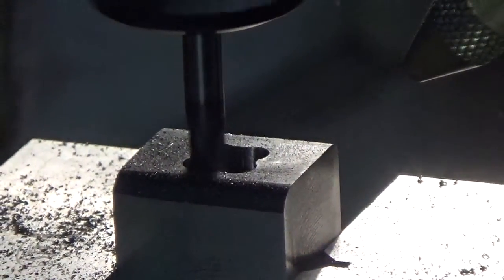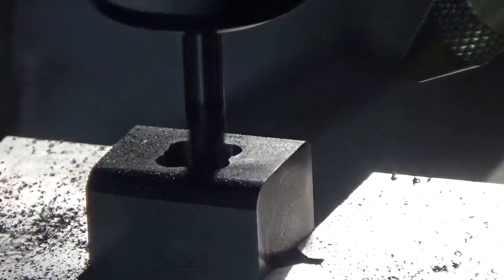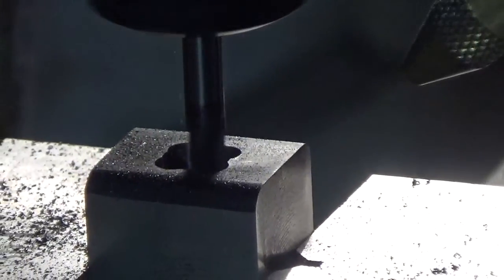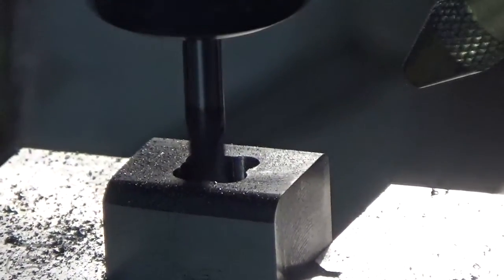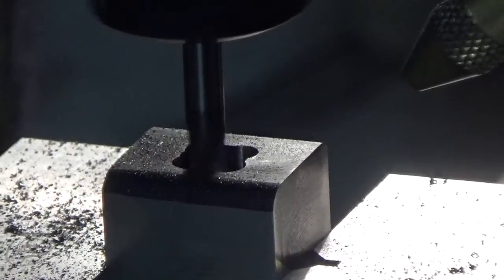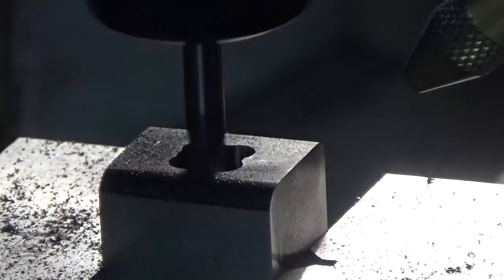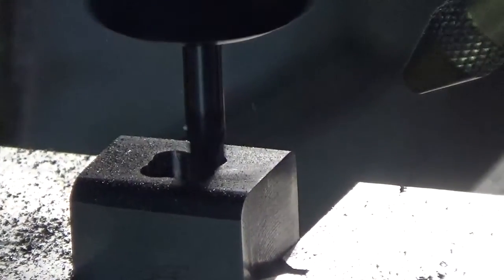If this works then I might try an eighth-inch end mill on something else, but we'll give this one a try. I'm down almost a half an inch already, so I'm halfway there. I've been running this program for six minutes — looks like it'll finish in about 12 or 13 minutes total. I'm running the spindle at 1500 RPM with a feed rate of six — probably could go more, but I'm not in any big hurry.